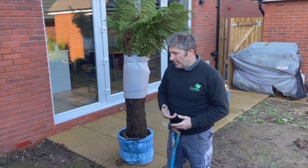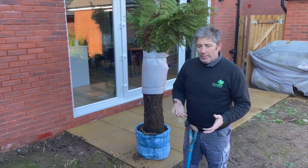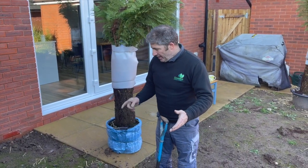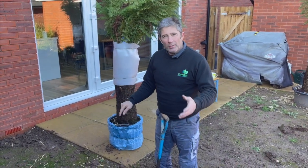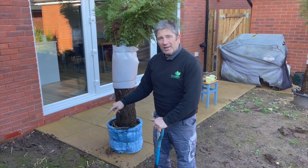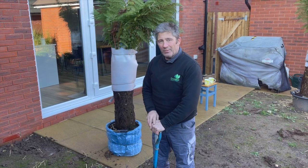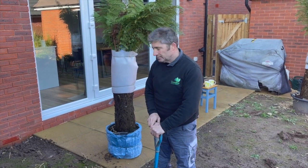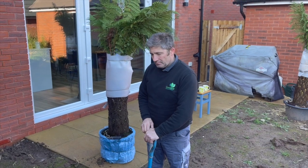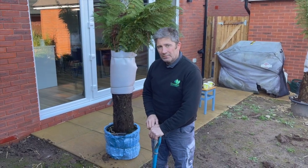I'm talking about this a little bit fast, but people are going to say we're not talking about a foundation. But ask yourself this: with this type of soil, that's this soft, do you think 100 mil would be enough? No, it wouldn't be. You need to go deeper, because even as it is now, we're over a foot deep and it's still very soft.